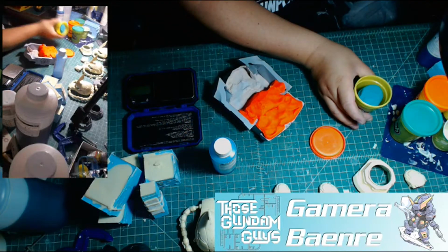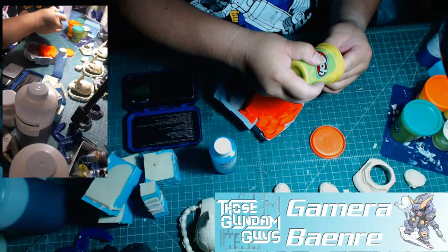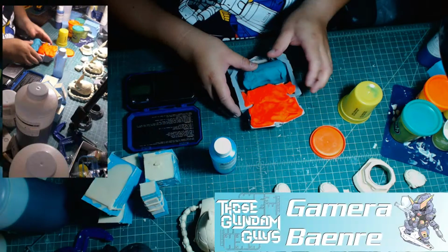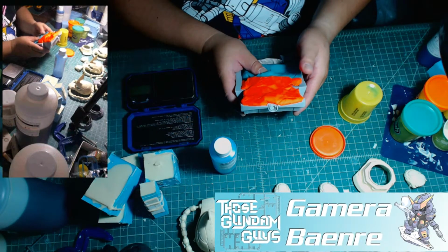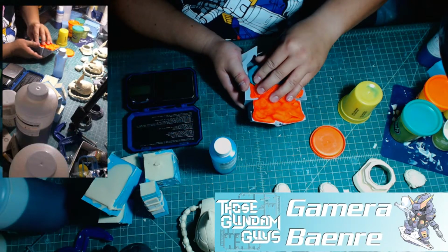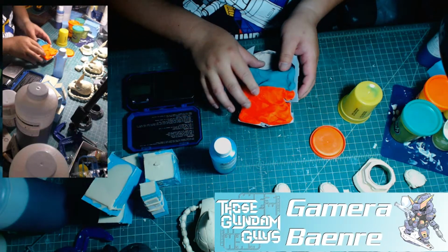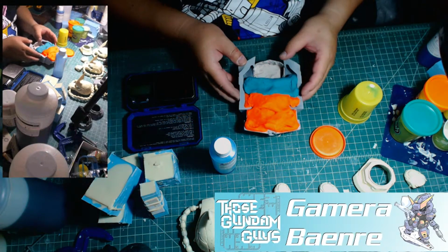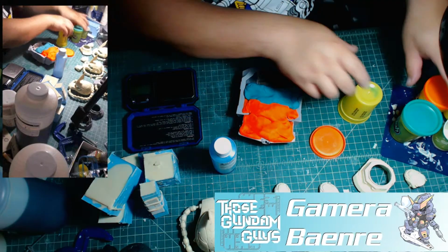What I'm using here is this PlayDoh. This is water soluble stuff, so it cleans up very nicely. A lot of mold makers will use clay. The clay is reusable as well, but I've just been used to working with PlayDoh because it's also very soft. It's very easy for me to work with and very malleable. And again, it's water soluble, so when I pull this out, the rest I can just clean up using warm water, and that will be the end of that story.